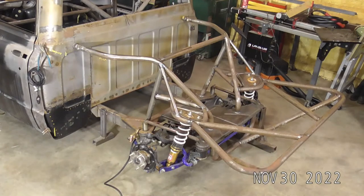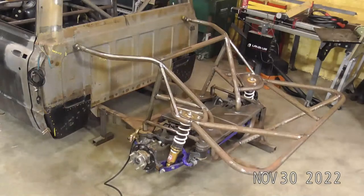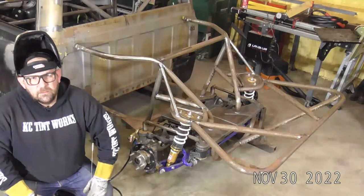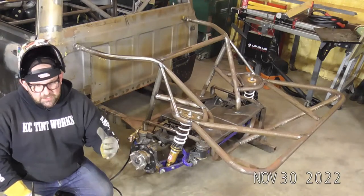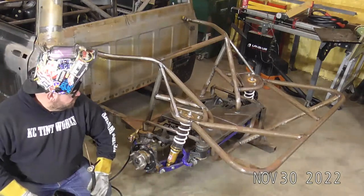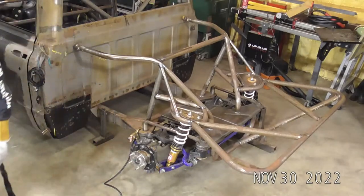And the filler rod, I keep everything in the rod tubes, or the rod guards. So I try to keep all the moisture off of it. Try to keep any other dirt and contamination from getting in the tube. So I'm pretty anal about keeping those closed up. My shop is climate controlled, so the humidity is not crazy bad in here. But the rod guards help out a lot with that. And then let me see one more.